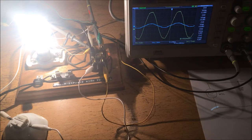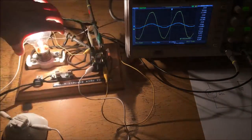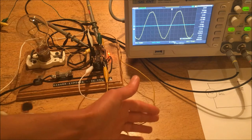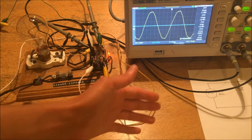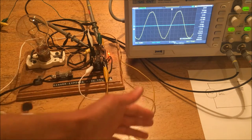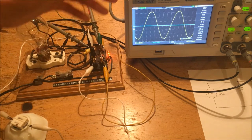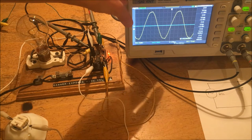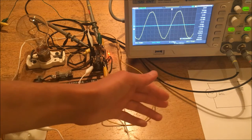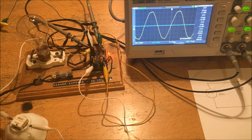The reason for this is that when an inductor conducts current, it builds up a magnetic field. And in order to maintain that magnetic field, it will provide whatever voltage is necessary to maintain that field. As a result, it will effectively dump voltage into the supply line — opposite to how the capacitor would dump current into the supply line — to try to keep that current as constant as possible. This results in the lagging current that you observed on the oscilloscope.